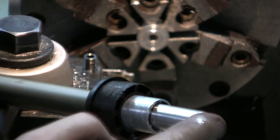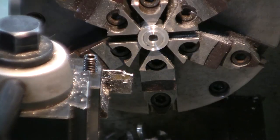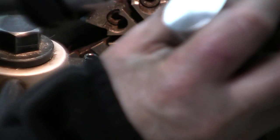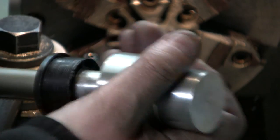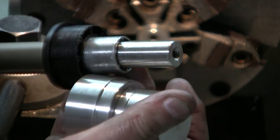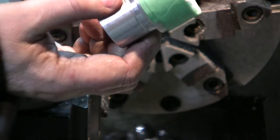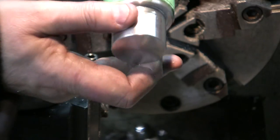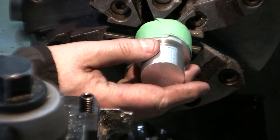It's going to go permanently in there and hold the top part I just made — there it is, was right under my nose. There's going to be a hole in this part there, and with a chamfered screw, once it's pushed inside there it'll hold everything together. The top part — I'm going to make the hole in the middle, chamfer it, and make it ready. I added masking tape not to mar the surface — that's my finished surface. I did exactly two turns, wanting even coverage all around.